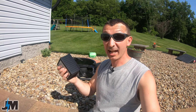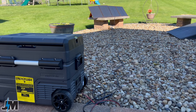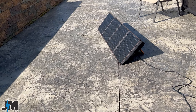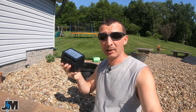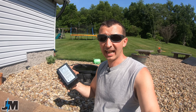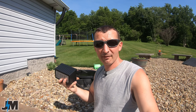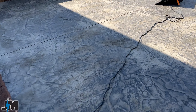A cool feature: when the battery is in the cooler you can run the cooler off solar and recharge the battery simultaneously. They recommend a 100-watt panel. I tested this with my 100-watt panel — ran the cooler non-stop all day with a fairly dead battery, recharged it throughout the day, with half the cooler on fridge mode and half on freezer mode. If I could take this to the BMX races, throw a solar panel out, and still have capacity after the sun goes down — that's pretty amazing.